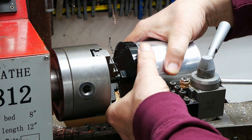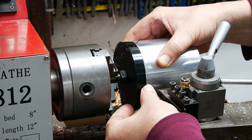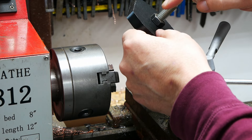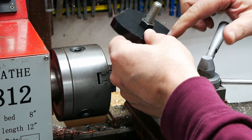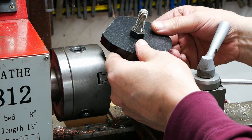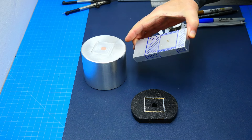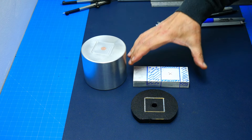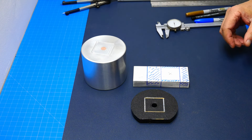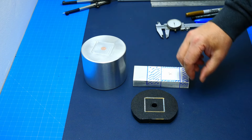It's not looking too bad — very clean. I think this will work out, and then we've got to machine out the center for our TEC, then bolt that onto the cup holder. So I marked everything up — this is going to be the heat sink for our TEC. I have this piece of 6061 aluminum and we're going to machine out the center where the TEC will make contact, and take both sides off.